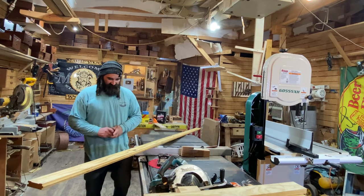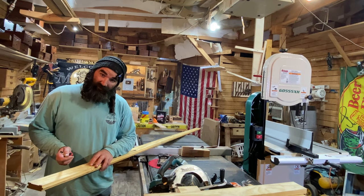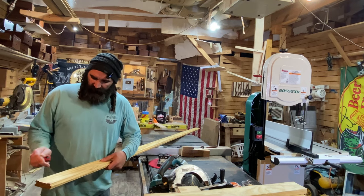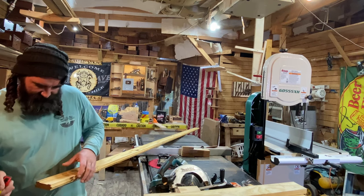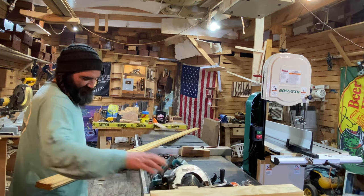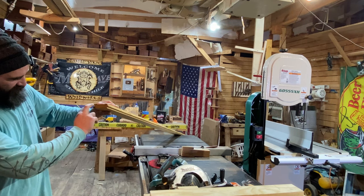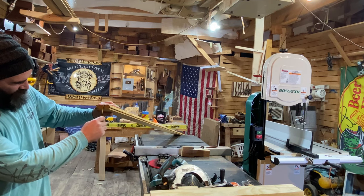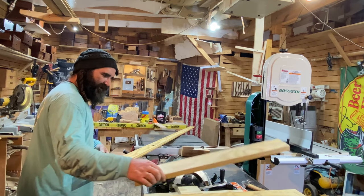Our next order of business is taking this tongue and groove decking that I have left over. And I'm going to rip the tongue and the groove off of it. And that will leave us with about 2 7/8. So we'll rip all of the stock we already have milled down to 2 7/8 along with this stuff. And I thought this would be 1 inch, but it has these 2 little humps right here that need to come off. And that will only leave us with 7/8. So ultimately, I'll plane this down to 7/8.